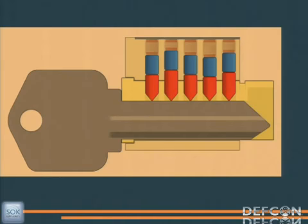So what you do now is, if you apply what we learned during the lockpicking bit, if you turn this lock, it won't open because there's a bit in the way. Because we now have filled up the whole space where the key belongs, it's no longer the blue parts, but the red parts. But the idea is the same. Because there's a big chunk of metal where your key is supposed to be, you can turn it left and right. So now it's one bit in the way, but if you turn the other way, hopefully it's another. So we have two places where pins are preventing the lock from turning. And that's good.